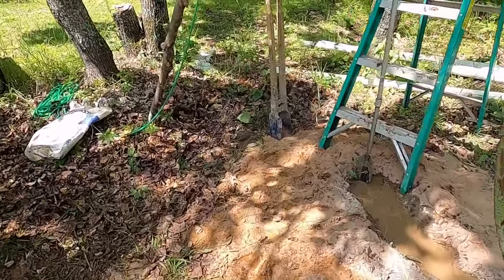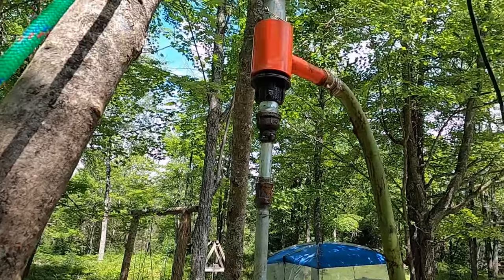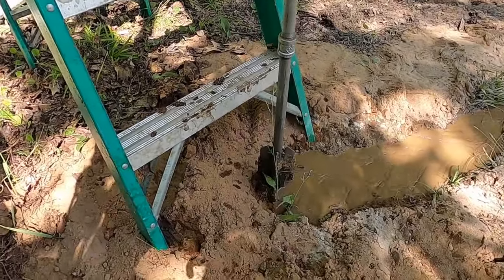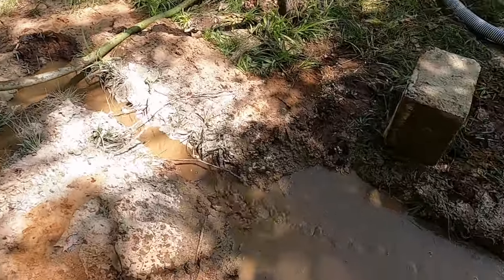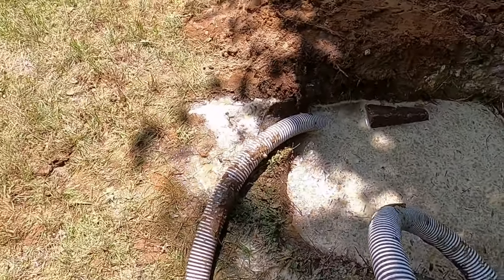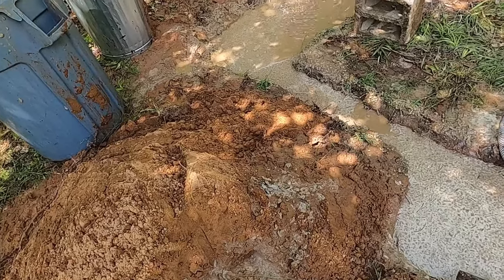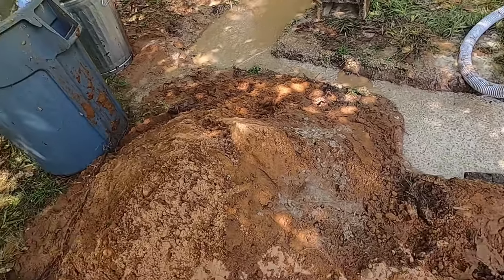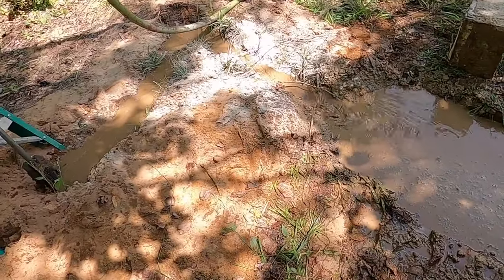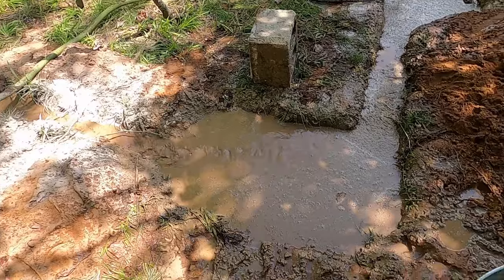We're getting close to starting to drill. And it's all hooked up. A decent amount of water, twice as much water as I would have thought. But I can feel there's a cake forming on the inside of the mud pits, and they're holding water, they're not losing water. But it's taking almost a full bag of bentonite to get it to where it's at right now.